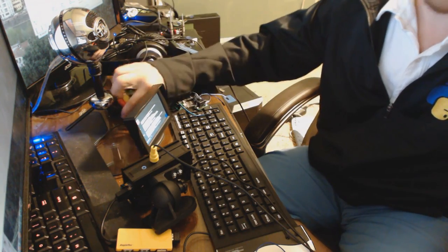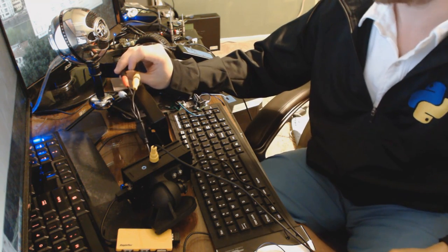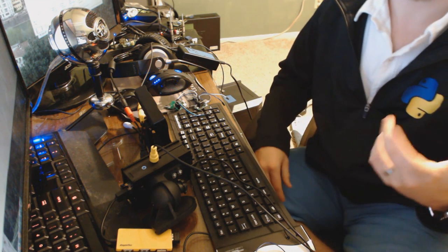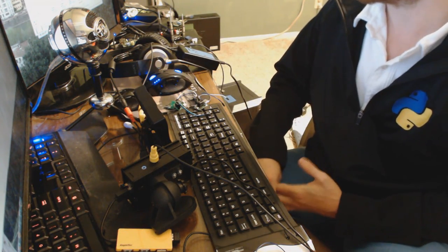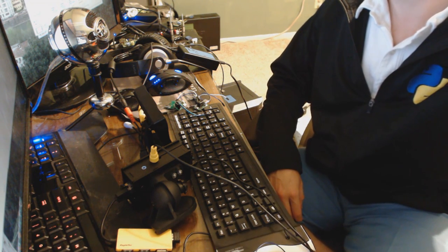So that's the screen — it's a composite screen. It comes with cables connected to the screen, but you'll need to get your own power supply. If you're using a car, it does come with a power supply with a positive and negative lead, so you can connect that to the accessories slot. Otherwise, you can wire it to just about anything — because the screen can turn on and off with the car's ignition, you can wire it to your cigarette lighter or to the overhead light, anything like that.